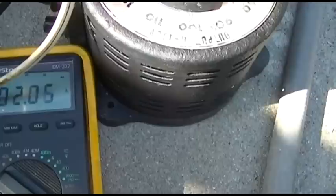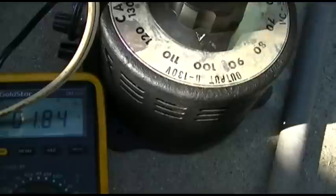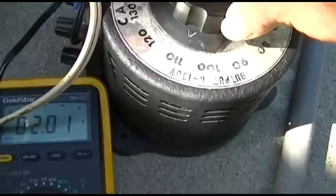There we go. I hear something. Yep. Look at the capacitor reforming. See it dropping here? Okay. That's the capacitor reforming. I'm at 100 volts here. When I move the tuner... I'm at 110 volts. Anything on picture? Yep.